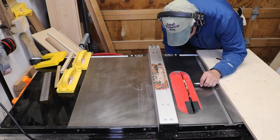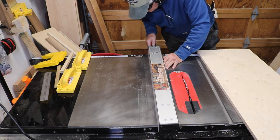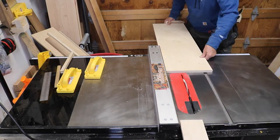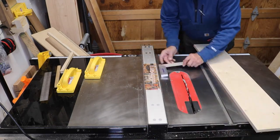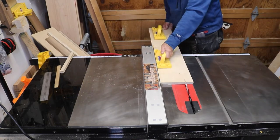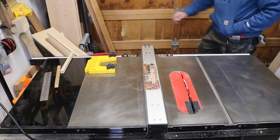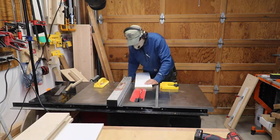For the straddle piece, which is going to be double-layered, I measured the size of my fence and wanted to add a little extra — maybe one sixteenth — so it would be wider than my fence, and I needed to add about a half inch on each side to go into dados on the upright pieces. While I was cutting, I went ahead and cut some extra sacrificial fences as well, making those the same size as the front: six and a half inches.